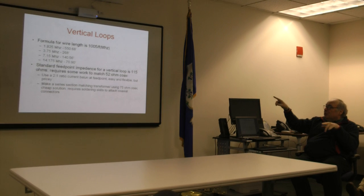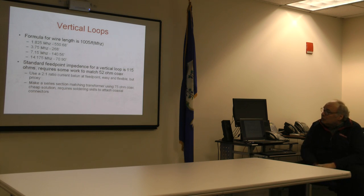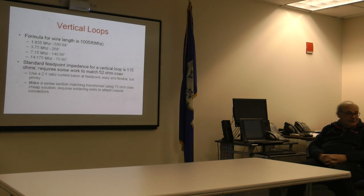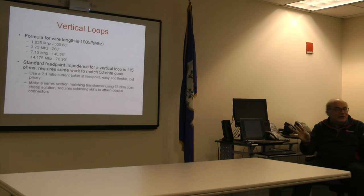All right, standard formula, you know, wire requirement, full size loop, 550 feet for 160, 268 for 75, 140.56 for 40 meters, and 70.90 for 20. I put the one for 20 only for illustrative purposes, because I've got to tell you, the main use loops you're going to find on 80 and 40. And sometimes on 160, though they sound a little impractical, there is still a way that you can pull that off. Now, what you have to deal with is that the standard vertical loop, whether you shape it as a rectangle, basically an equilateral triangle, any of the normal configurations, is going to be 115 ohms. That doesn't match standard coax either.